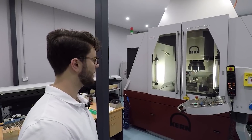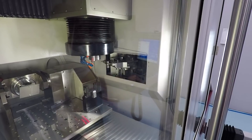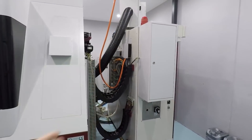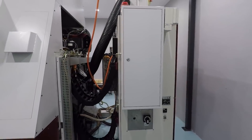The other anecdote was when we saw our first Kern CNC machine at Nicholas Hacko, the watchmaker in Sydney, Australia. That Kern has as many things that generate heat — like the electronics — literally separated from the machine to thermally isolate them. That's something you see as you step up to more expensive machines: active cooling where they pump liquid through the casting or through the ball screws, more measuring points to measure temperature, and either active cooling or software-type compensation.